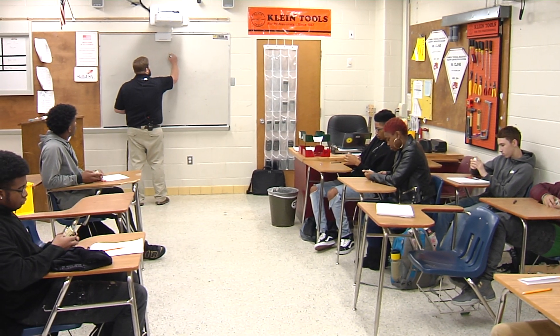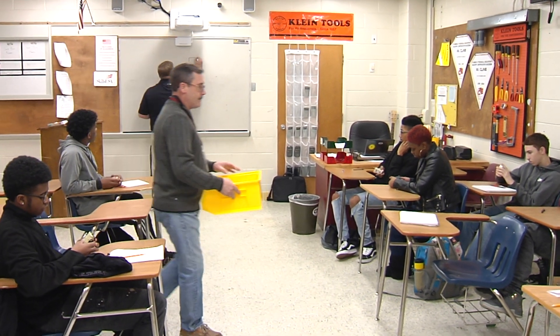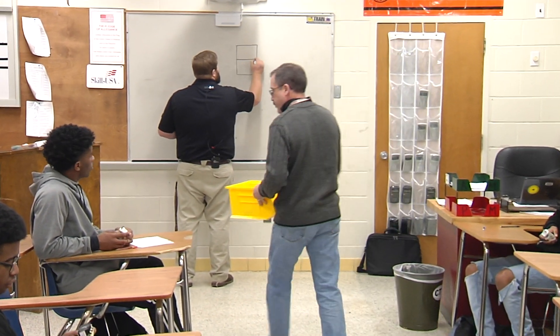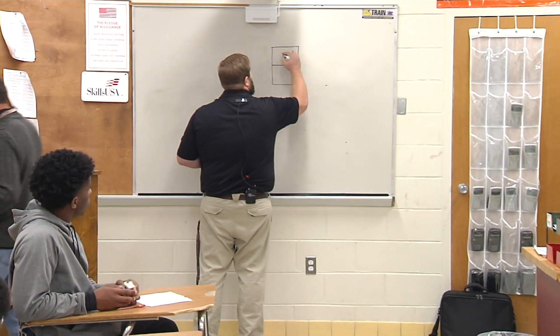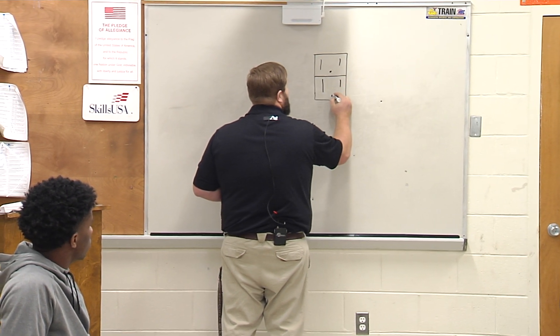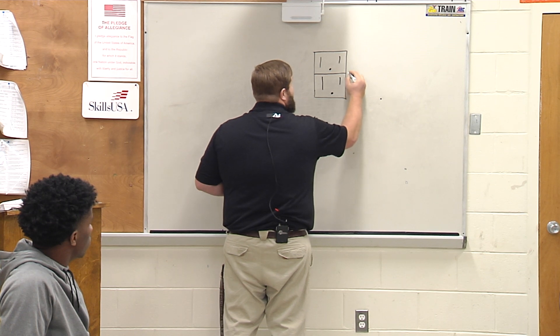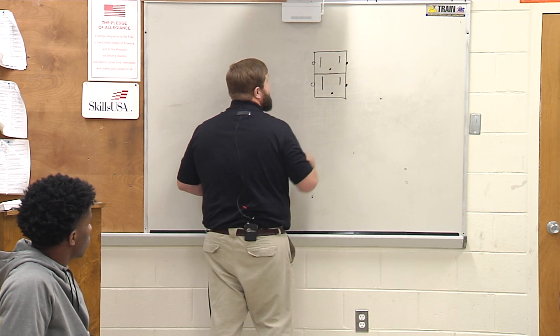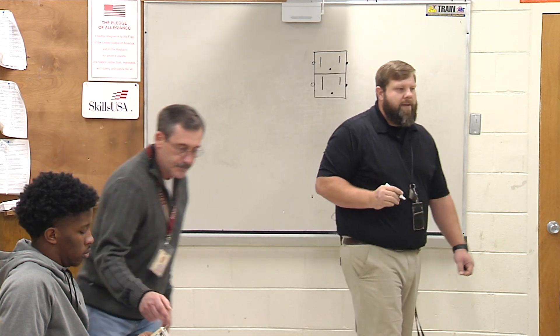So when you're drawing a GFCI, we're going to draw it just like it looks. It still has the short on the right, the long on the left for the hot and the neutral — short, long, and the ground. Darkened-in circles are still on the right because the screws are the hots. The neutral side is on the left with open screws.